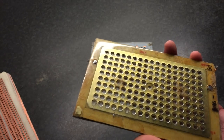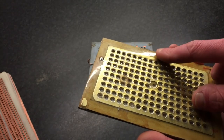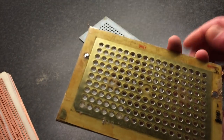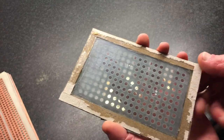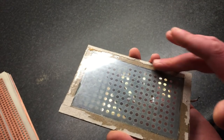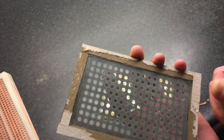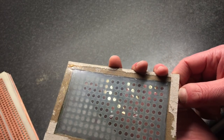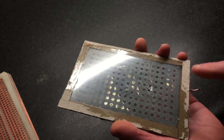You should look up the breakdown voltage of both materials, but this lacquer is not so flexible. For instance here, this is a really old panel — it cracked, so you can see the bare copper. Another thing is that they didn't put copper on these edges, and that's a good idea. Normally it would be, I think, a polystyrene frame, like this. Here it was carton, because I couldn't find any materials back in the day. This worked out okay-ish, but it's definitely not ideal, because carton can get moist and is not the best insulator to begin with. So, don't do this as I did.